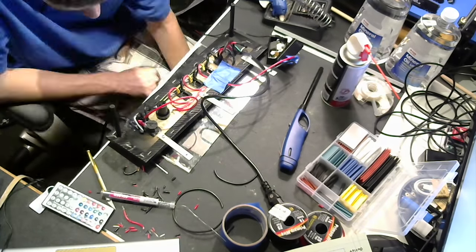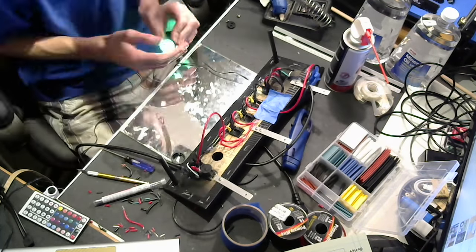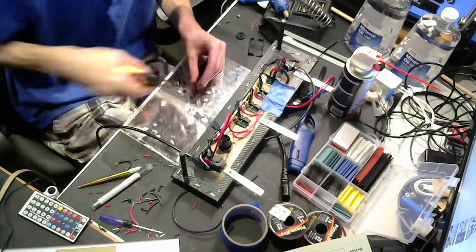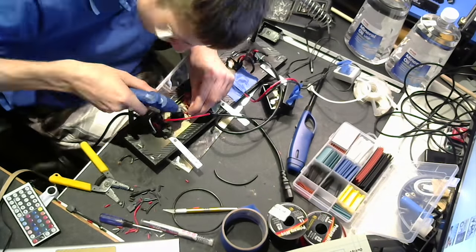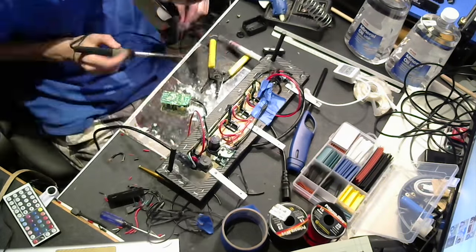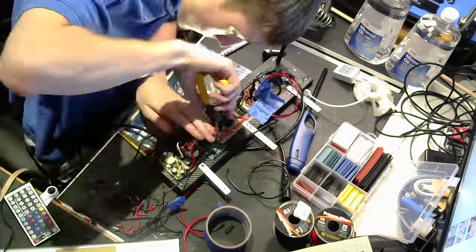Also something to note, the ground wire passes all of the switches and is directly connected to the rest of the NEMA power cord. This is very important to know because you need to ground your system or else something bad happens. The overall idea behind the circuit is to allow the user to turn off the lights, pump, or just the computer without compromising the rest of the system. So the only way to turn off everything is to toggle the main switch.